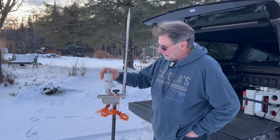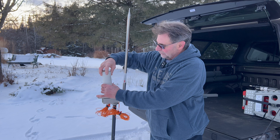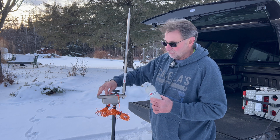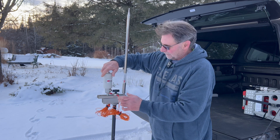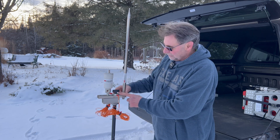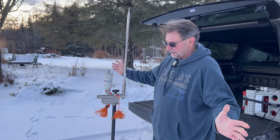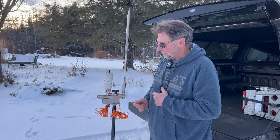This is Chameleon's coil. All I have mounted on top of that — and I'll show you close-ups in a bit — is a three-eighths by 24 rod nut, just for screwing this on. Once that's on, everything's connected via the seven-eighths stainless unistrut to a puck in the middle for ground radials. Four millimeter ground radials — plug them in, do whatever you want. You're ready to go.